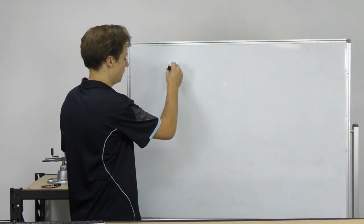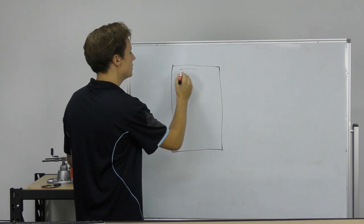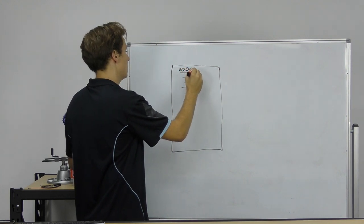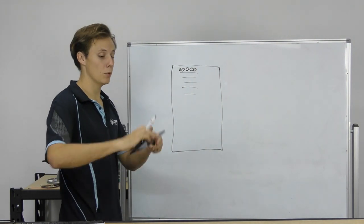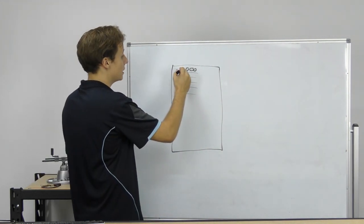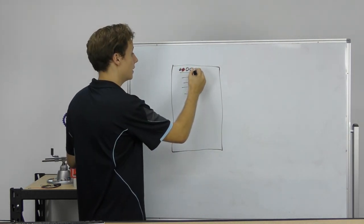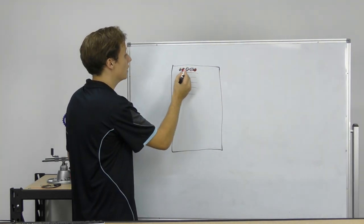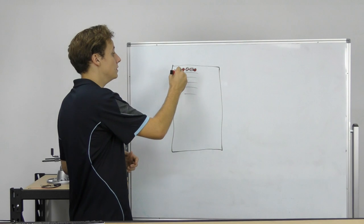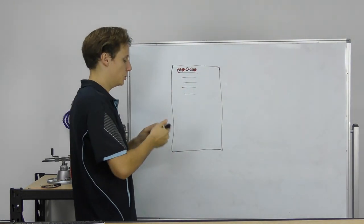So, a typical breadboard, a nice, almost rectangular shape, will have a series of rows, and each of these rows has 5 holes in them, and they are all connected that way. So you can see on the breadboard here, or in the image on the text area, that there's 5 rows and they're all connected to each other. So if I put a leg of a component here, I'll use the red one, leg of a component there, it's going to be connected. If I put a leg of a component there, they're going to be connected because there is an electrical connection running through those holes. But this row is completely isolated from that row. They're not connecting at all. So if you wanted to connect these two rows together, you would first need to get a small jumper or a piece of wire or something like that and connect two of the holes together.